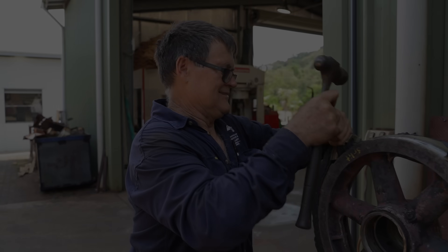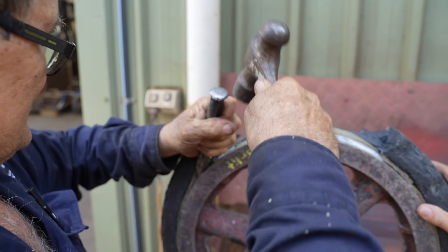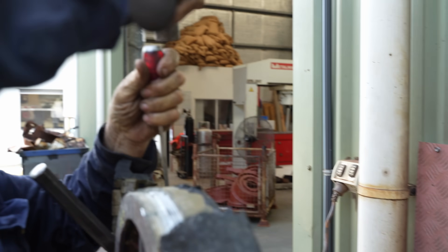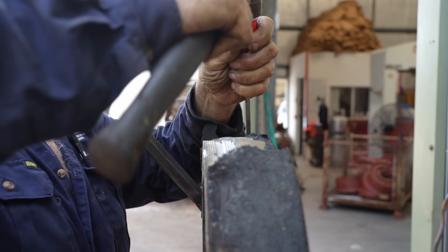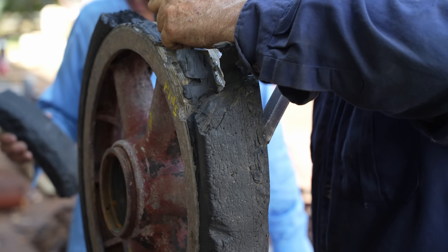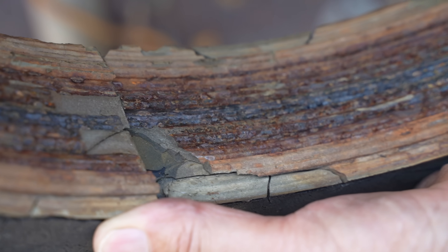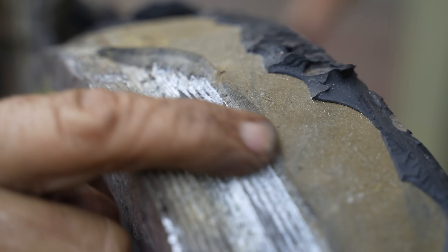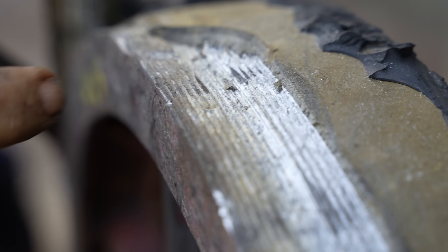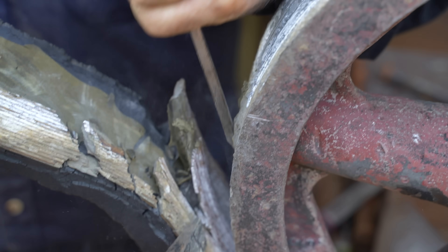Previously, we were a little bit worried about the rubber on some of these wheels, but luckily we found a place in Toowoomba that could put some new ones on. But first, the old tyres have to be taken off. While Daz and the museum director were doing this, we noticed that we actually had two different types of wheels. One has tyres bonded to a steel band that presses onto the wheel, and the other has bonding grooves machined onto it, removing the need for the rubber tyre to have a separate band.